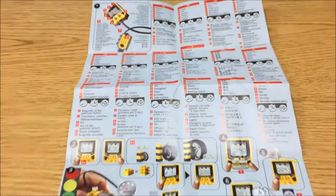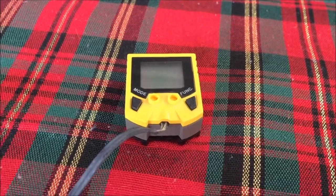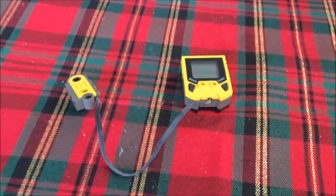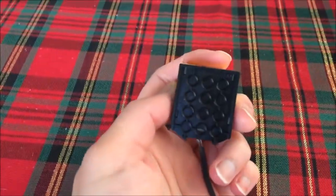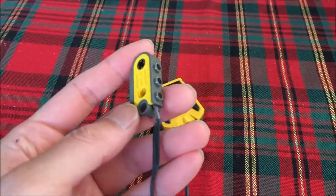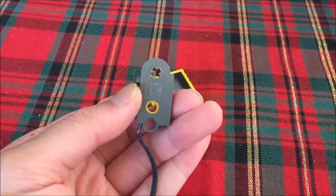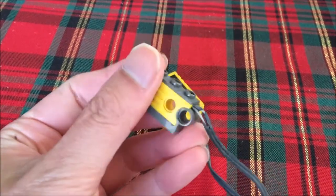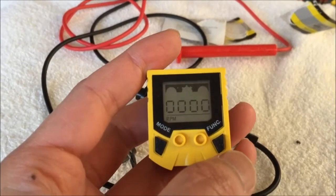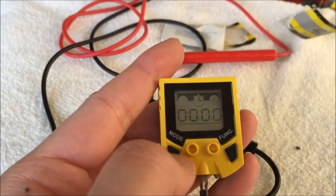Unfortunately, the early 2000s vintage means that the cable is made of garbage and will need to be replaced. Even more unfortunately, taking the computer apart is semi-destructive to the casing, though it does not require any special tools. On the other hand, replacing the wire is more straightforward than replacing the 5306B wire, though you will need a soldering iron. We briefly checked that the unit powered up before starting the disassembly.